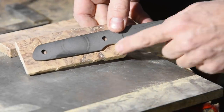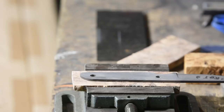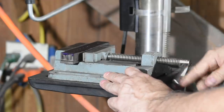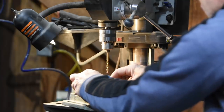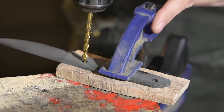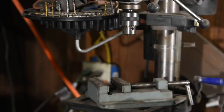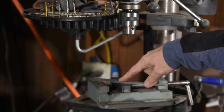I'll be drilling the rivet holes next. When you do this it's really important to have them as perpendicular to the handle as possible. Ideally you'll want to use a drilling vise and a drill press. If you don't have either of those, you can get by without as long as you follow the same sequence as I do. If you get out of sequence you can end up having holes that don't mate up properly, which puts you into the do-over-from-scratch mode.